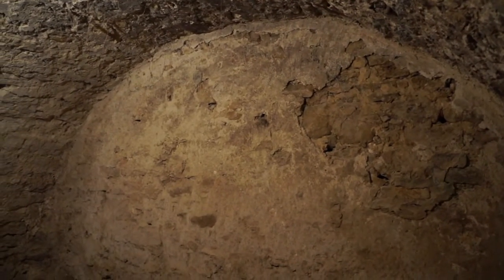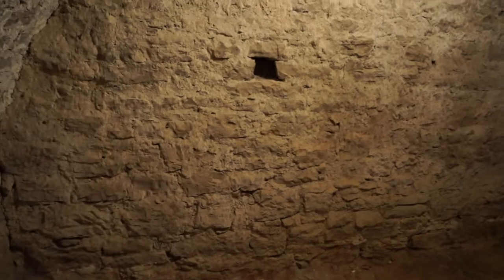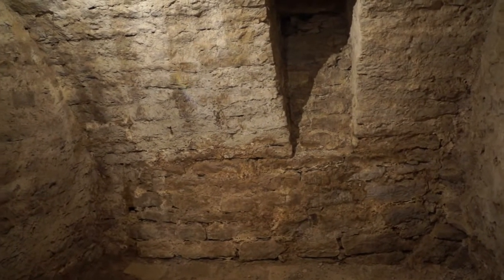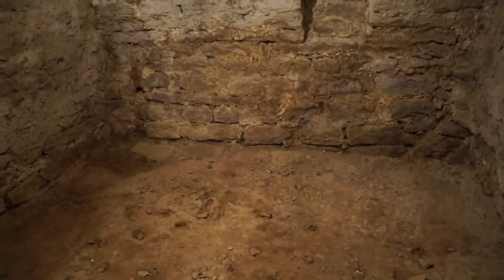So today my son and I are going to start knocking off bits of plaster on this wall on the east side, and start cleaning off the stones - basically see what they look like. The ceiling definitely doesn't have much plaster, and the other wall you can see the stones already. Get the plaster off first, then use an angle grinder with a brush attachment or a wire brush by hand and clean the stones off, see what condition the mortar is like. It's a dirty but easy job and we can finish this off fairly soon.